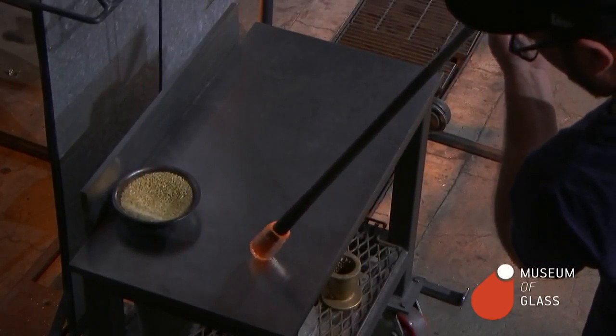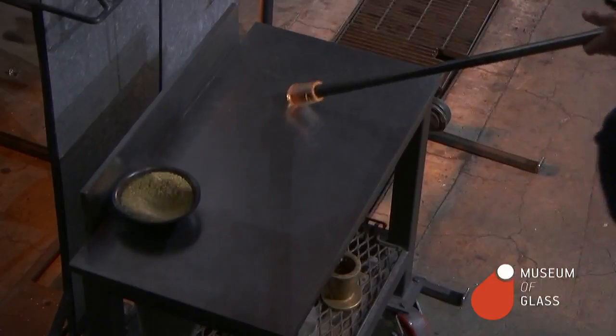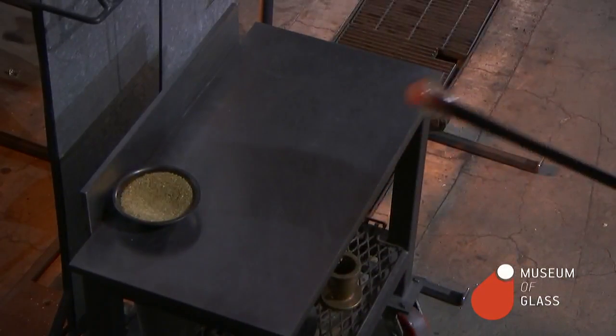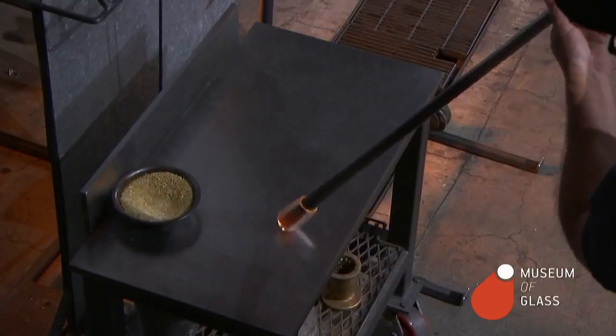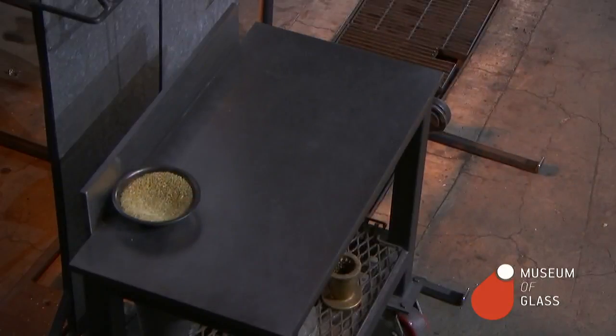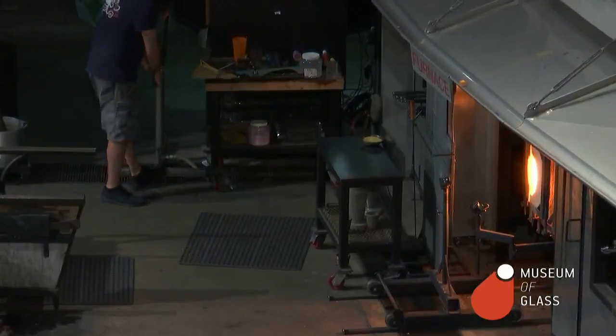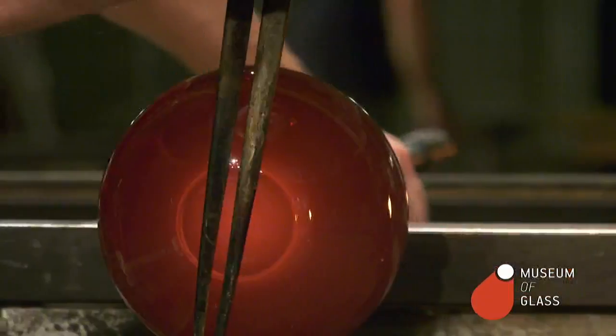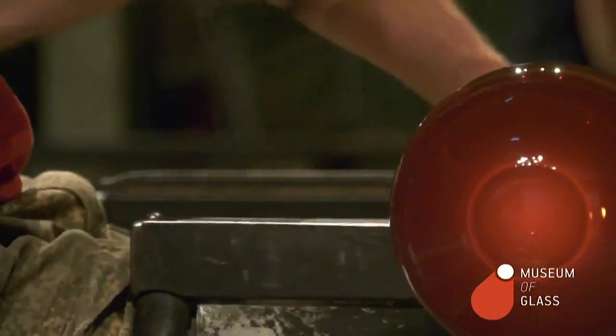When we're bringing over this transfer rod, it's very important that it goes on at the proper temperature. Not too hot, not too cold. Too cold and it won't fuse properly and the piece can break. Too hot, it fuses together and it becomes quite difficult for it to break off. So there is a small window to work from. Again, we have a professional crew down here.